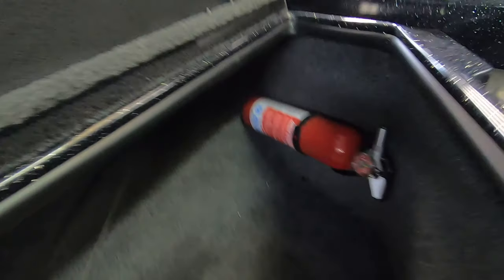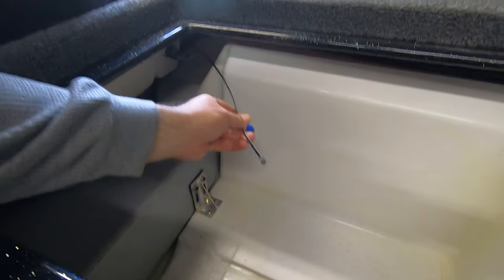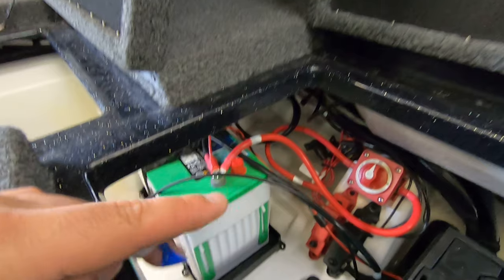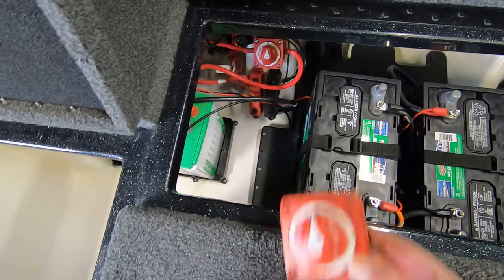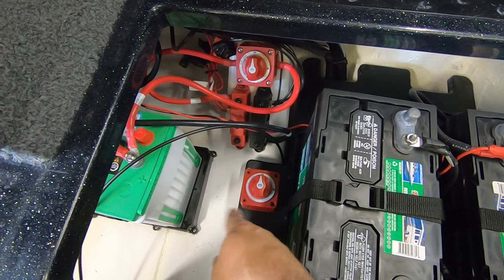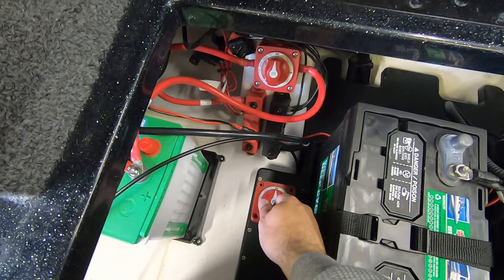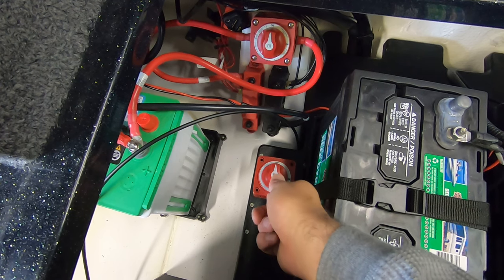We have success. I ran the fish tape in the gap up in the corner and it went right along the side of the boat and came out nicely at the battery compartment. I'll bundle my power wire up against the other wires so it comes back neatly. I'm going to mount the new switch in this general area so the power comes from the black box to the switch and then straight over to the starting battery. Off is in the top position.